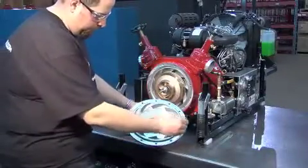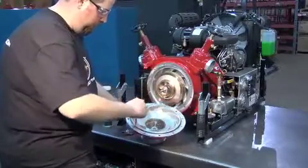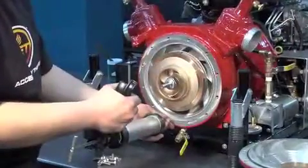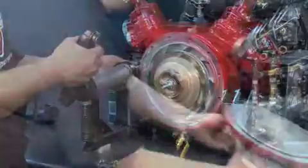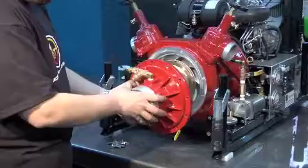Put grease over the top of the o-ring of the cover, the entire circumference. Put grease on the waterway part of the impeller. Put silicone in each hole of the casing. Reinstall the cover and screw the bolts at up to 30 foot-pounds of torque.